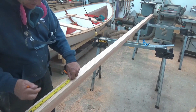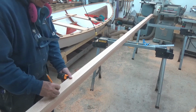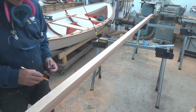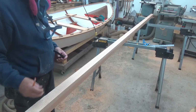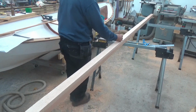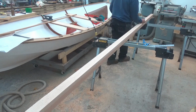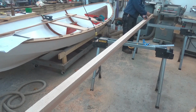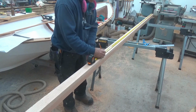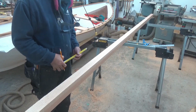So then we're going to go 9 inches from the bottom here, leaving me 150, divided by 6 is 25 inches. So my taper for the mast step, sitting through the partner and into the mast step, will start to taper there down to the final diameter at the bottom. So 25 inches makes a reasonable mathematical number to figure out. 100, 125, should take me to 150. Bang on. All right, so that's a pretty simple number to remember.